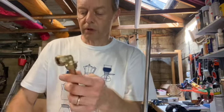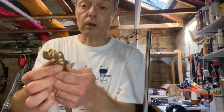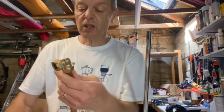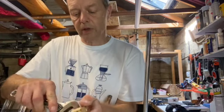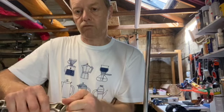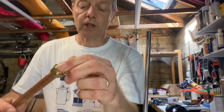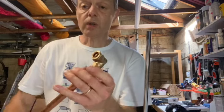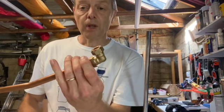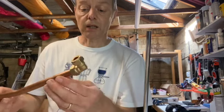Maybe a little bit more than you would do with a door handle. If you do it too much you'll damage the olive and it'll leak. The best thing to do is tighten it until it doesn't really turn. That's fairly fixed now, so that should be okay. You put it on, turn the water on — if you get a slight leak you can always take your spanner and just tighten it up a little bit more. If you've over-tightened it, it will leak and you've got to switch the whole thing off and take it off again.